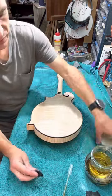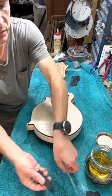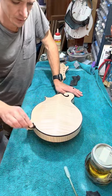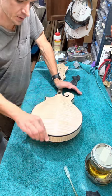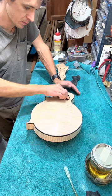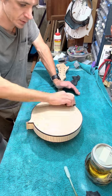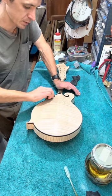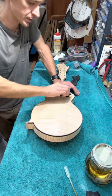I'm just going to do a few more passes of shellac. I have the pipette and it goes on this little pad, and I just kind of go back and forth to build up a base coat layer, and watch it gas off as I go. You want to move pretty quick — if you go too slowly, the pad's just going to stick, and that's going to leave some fuzz or lint or a weird little spot that you then have to go scuff sand out.